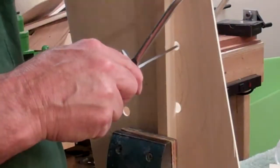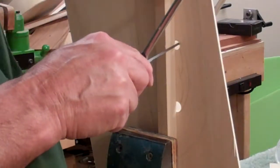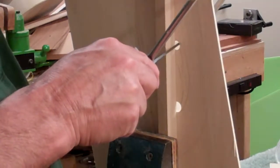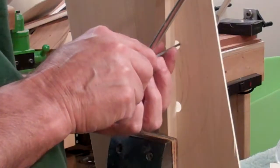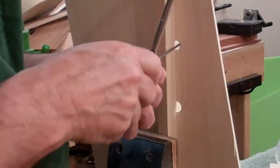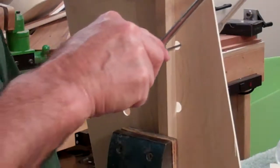I installed the fine-tooth blade. I turned it to a 90-degree angle to the handle, and when I secured my wood, just so it wouldn't flop around as much, I put a piece of wood on each side just to tighten it up. And I made sure when I installed the blade, the teeth are pointing down to the handle. They're pointing down, so you're cutting on the backstroke. Just take your time and leave the line.